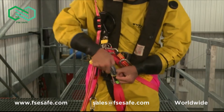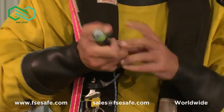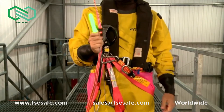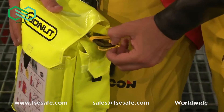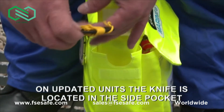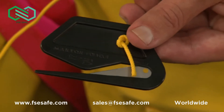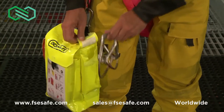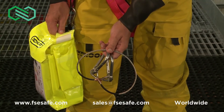Other accessories include a chemical light stick fitted to the center strap of the harness. Tap the tied end on the descender handle, remove the clear tube, and bend it to activate. Use the light stick to attract attention. Under the top flap is an emergency knife with a guarded blade attached to the bag via a lanyard. Use the knife only as a last resort to cut yourself free from the Donut or to assist others. Inside the side pocket of the bag there's a wire strop for attaching the unit to any potentially sharp or hot surfaces.